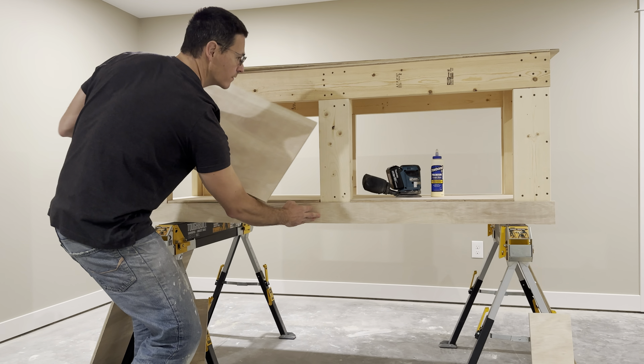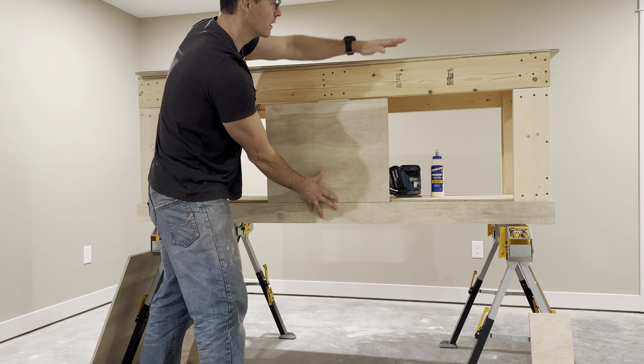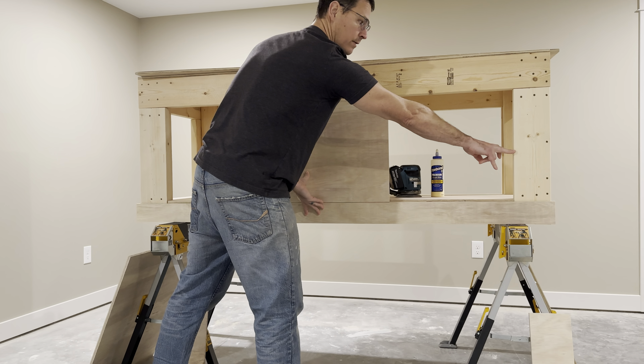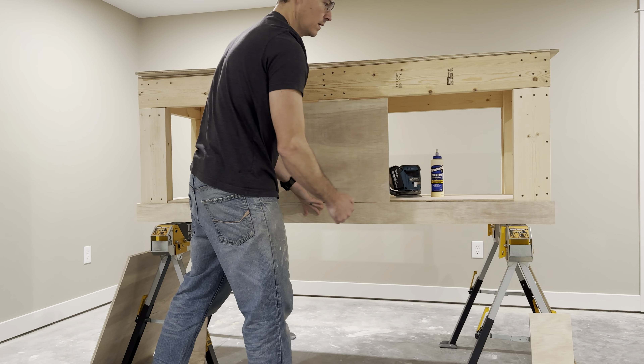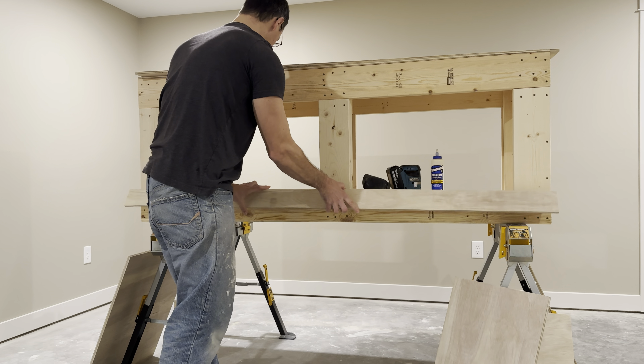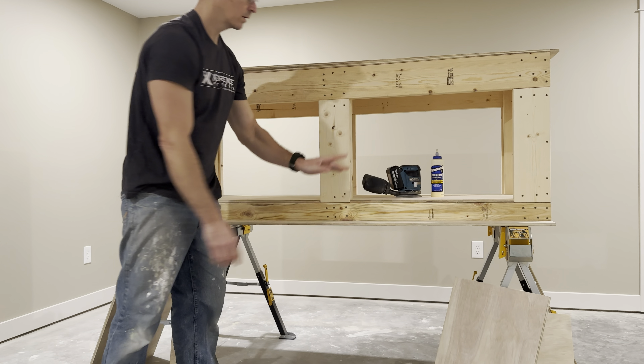The openings for the doors are 20 inches. The top piece is going to sit here and come up above by two inches, which will hide the bottom rim of the aquarium. The doors will hinge from right here and each open outward. I haven't cut the doors yet, but that's coming. Before I cut the doors, I'm going to glue and attach all of these panels and then revisit the video.